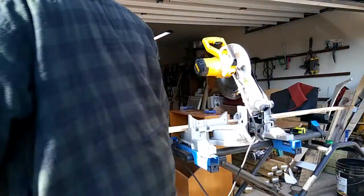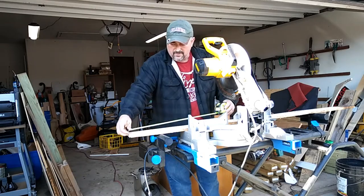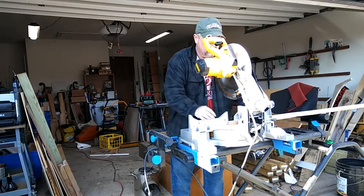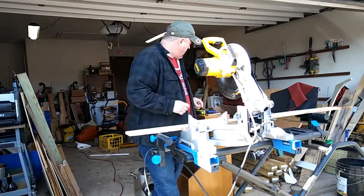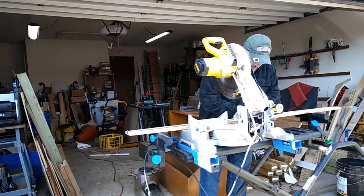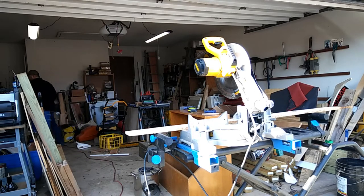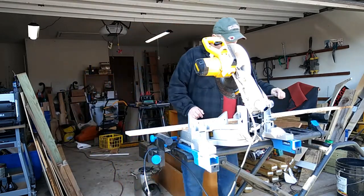All right. First thing we're going to do, we're going to measure off these fence panels. I tried to find the straightest ones that I possibly could. We're going to mark them off at 36 inches, but what I want to do first is just barely nip the edge of this. It's got a staple on the end of it, and I want to make my own straight edge for it. Now we'll mark it off 36 inches. That's going to be the length of this shelf. Cheat a little bit. There it is. And pop that off.